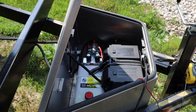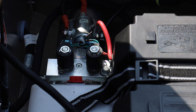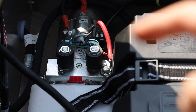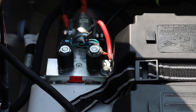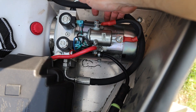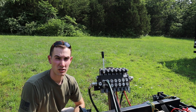With the remote, when you press the button you can see these solenoids — these are your valves. It powers a solenoid, which activates the pump. That solenoid opens these solenoid valves, and depending on which way you press the button, fluid flows out one side or the other. This here is your motor running the actual pump, this is your pump, and this is your reservoir.